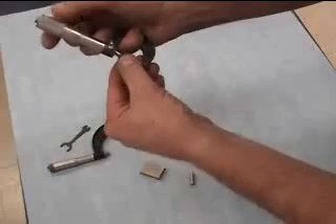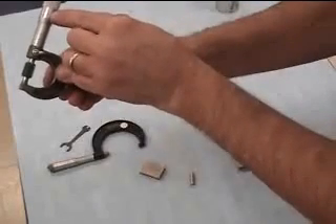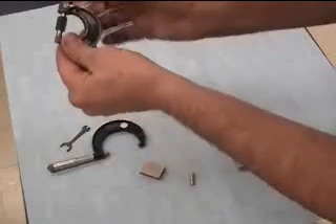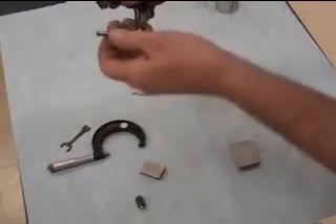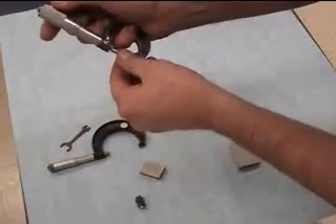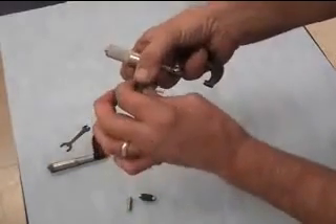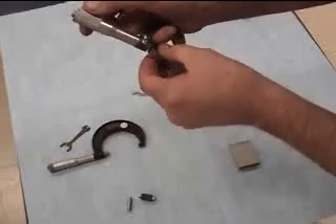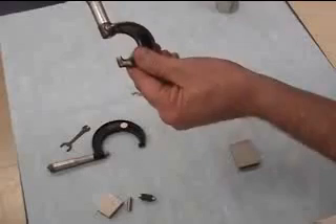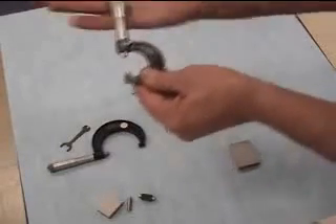There are several standards available. This is a one-inch standard, and with the one-inch standard we are dead on the reference or datum line and the zero on the thimble. My vernier scale is zero, and it's zero here — so this micrometer is now calibrated. Starrett likes to use these little calibration standards — you can see it says Starrett — but they're rounded. I often use a gauge block to check the calibration of a mic. You always want to check it closed and open. Sometimes if the mic has been dropped or the threads damaged, it may read zero at one end and maybe a couple tenths off at the other — that's when the micrometer needs to be tossed or repaired.